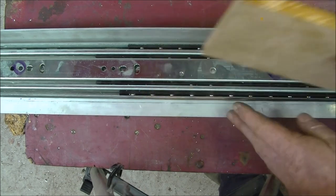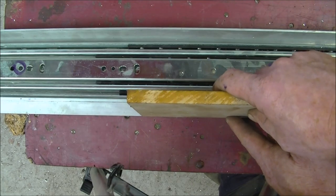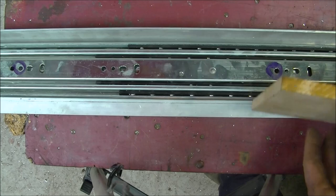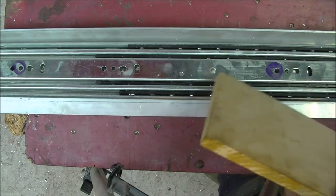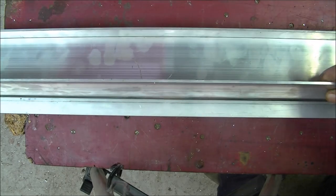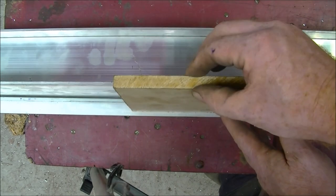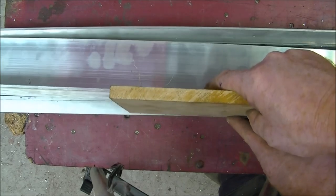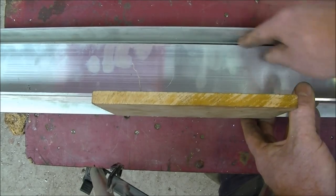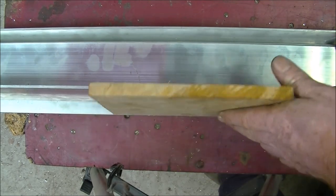The only reason to keep it above the back edge is if you're making it for a small fridge but might want it for a bigger fridge one day — you need that to sit higher so the fridge sides don't rub against that edge. We'll make it to fit this fridge and the next size up. I've got a 29 litre but it's the same width as a 40 litre. Work out your thicknesses first — in this case I'll be using 12mm ply. I need clearance underneath to stop anything from jamming.